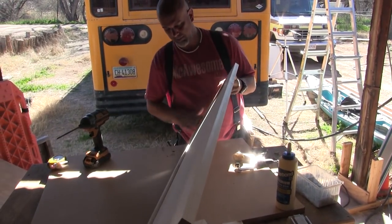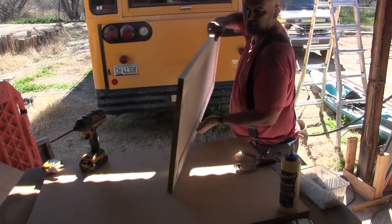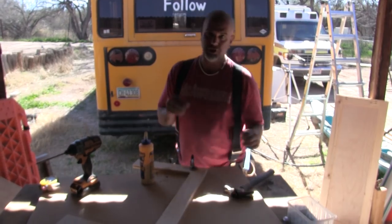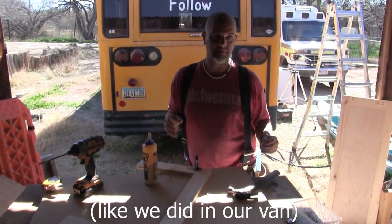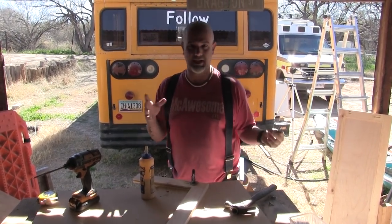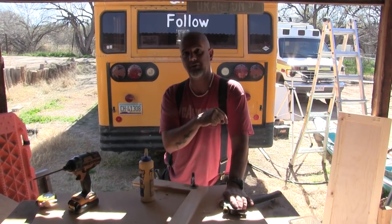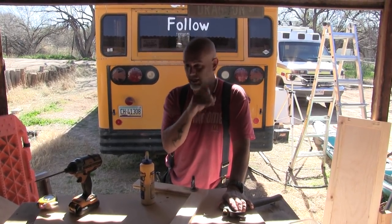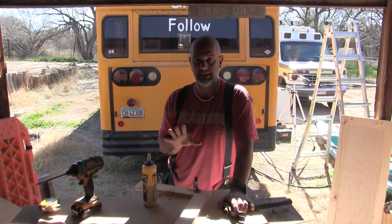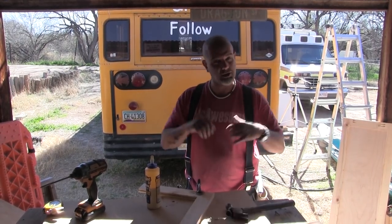When they're done you just get these perfect I-joints on the face that we can sand — it'll be perfect and so beautiful. I caution you guys watching this: don't build a two-by-two frame for all your cabinets. On the outside appearances it'll look nice, but on the inside you're going to have a lot of difficulty hanging shelves and everything else. I strongly suggest you look up the proper way to make cabinets or watch our video on cabinet making. You don't need any two-by-twos — the way it goes together holds it square, it's very easy to make, and it will save you so much heartache in the long run.